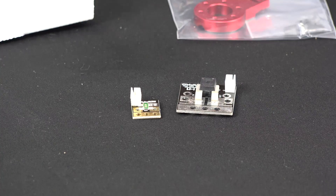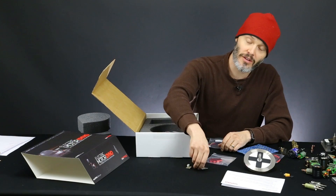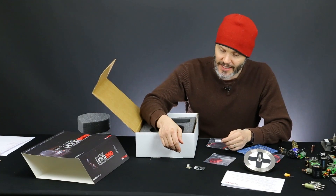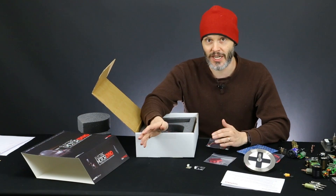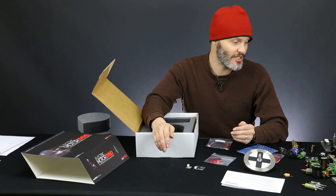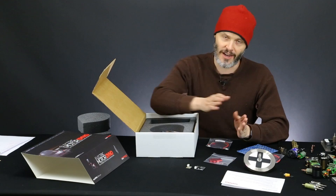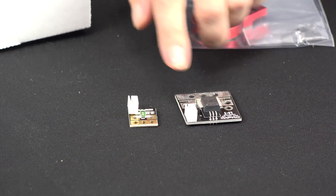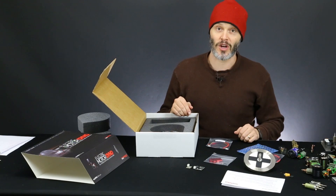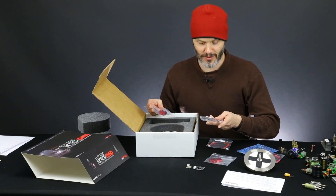The current will pass all the way through this hall effect sensor and it will have a little voltage bias — just like a normal hall effect sensor in your motor. When there is a change in the electronic field and magnetic field around it, it'll change the voltage bias one way or another. In a normal hall sensor in a motor, it would go from zero to five volts. This one probably goes zero to five but in a more linear fashion as the current ramps up. Big beefy traces on there — this one will definitely allow a lot more current without going up in smoke. My motors are very powerful and they need all the current sensor we can afford.